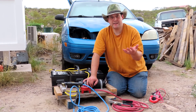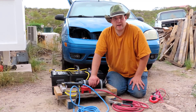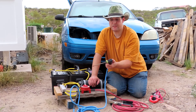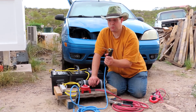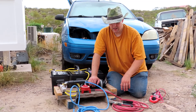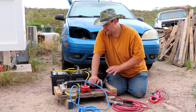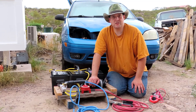I'll put a recipe with all the information in the description so you can look at all the parts and build one of these yourselves. You can get smaller batteries — with smaller batteries and their peak current, you could probably use 3/32nds wire. I'm going to get three motorcycle batteries later and try it out to see what kind of welding results. For big stuff, these three Group 29 marine grade deep cycle batteries will power through it just fine. I like this little setup — I'm going to make some sides for it and a carry handle to make it into a case. If the motorcycle batteries work well, we'll mount them on the back side, and the wires will fit in the little front compartment.